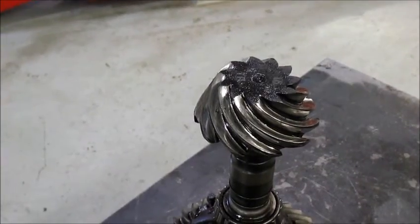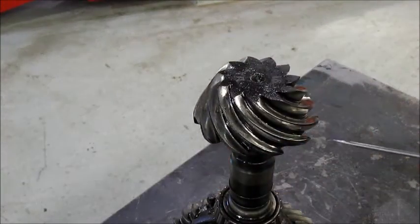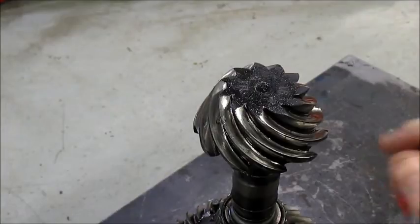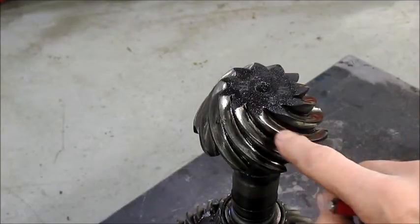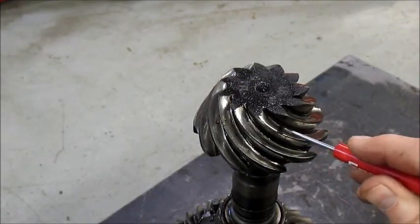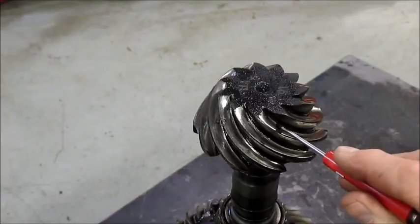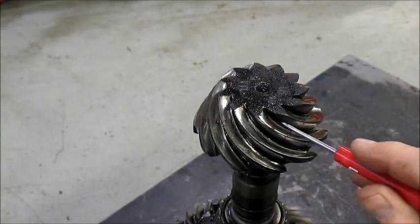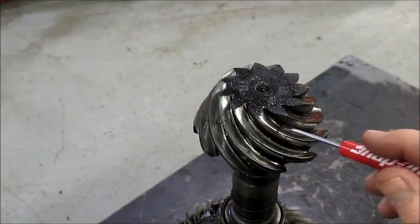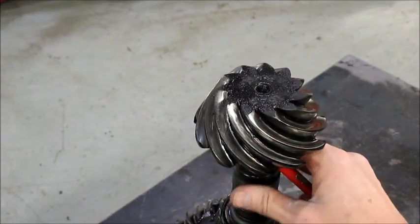A little bit more on this ring and pinion — it makes a nice little stand. Looking at this drive pinion, how it's worn down almost to a knife edge, there's a little step down in the valley at the side of the tooth. It's worn down so far that there's a step there. I'd estimate there's 30 thousandths of material gone — at least on this end of the tooth — at minimum 20 to 25 thousandths. That's pretty impressive wear.